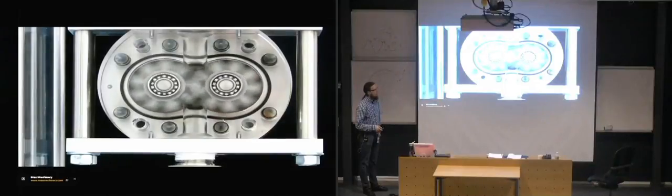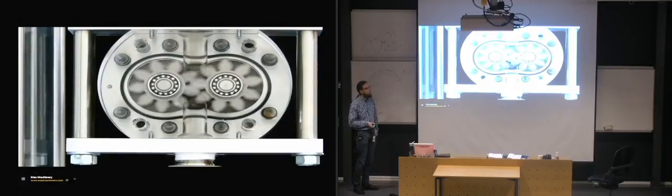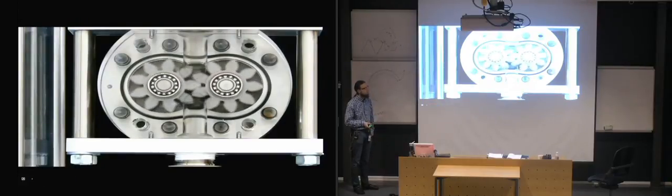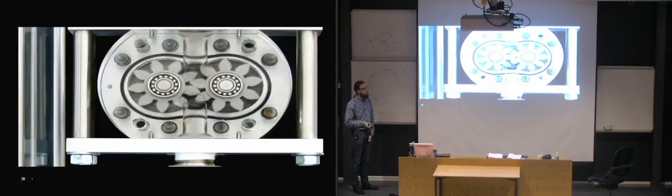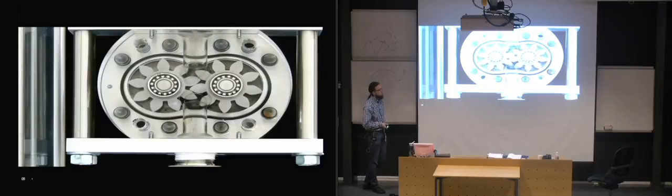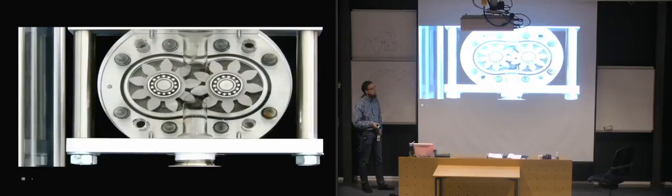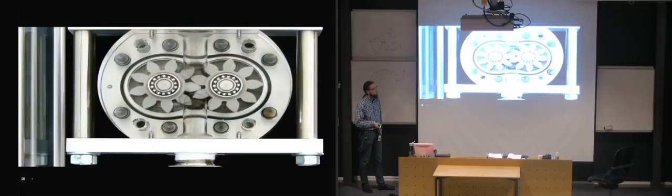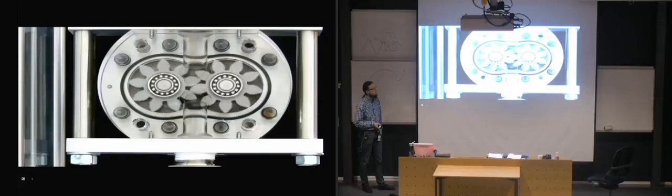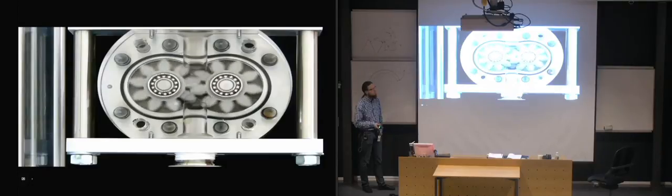Positive displacement flow meters divide a flow stream into fixed, known volumes and count them to determine the total flow and flow rate. In a gear meter, the measurement chamber is created by the gaps formed between precision-engineered gear teeth and the meter's body. As liquid pushes against the gear teeth, the gears progress and isolate a volume of fluid. As liquid continues to enter the meter, the trapped portion of fluid is carried along by the gears until the fluid is released into the downstream side of the meter. This process repeats itself continuously. You will notice the meter is impervious to intermittent or start-stop flows and changes in viscosity. This is unique to positive displacement meters.